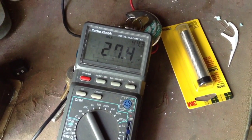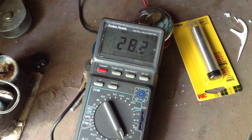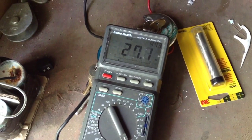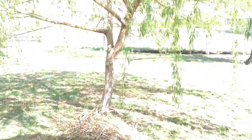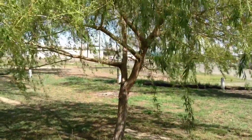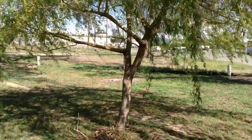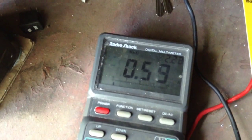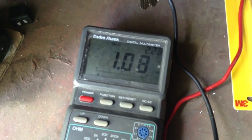I'm thinking about taking the coils — I have three sets of coils now, all paralleled together — and dropping down to six sets of coils, all paralleled together. Where we're at is 24 to 25 volts spinning that fast. If I drop it in half, in theory I should still be able to charge the battery at that rotational speed — that would be my cut-in speed, basically. Anything above that would just start generating amperage to go into the battery. Amperage-wise, so far today the max I've hit is two and a third of an amp.